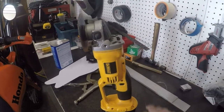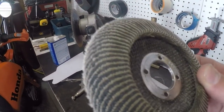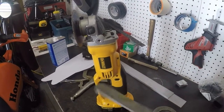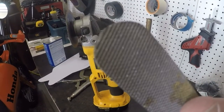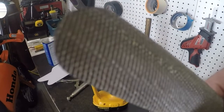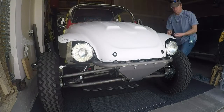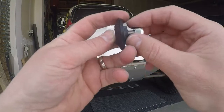Then to clean it up and round the edges I'm gonna use this — what they call a flapper wheel — so I'll use that for some of the cleanup. And then when I'm done with the flapper wheel I'm gonna use this file. The only reason I'm gonna use the file is the flapper wheel will leave some fibers and whatnot, so it'll have a little bit of a stringy look. If I go around all the edges with this file, it will take off the fibers.